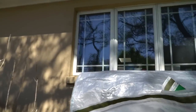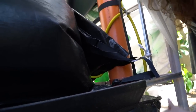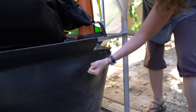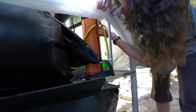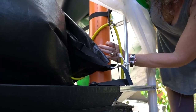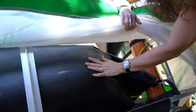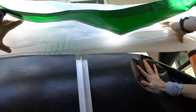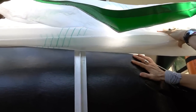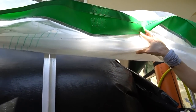When you put your food scraps in, they go through the sink — this is the input — into the digester tank, and that's where all of the digestion takes place. As the bacteria decompose the food scraps, it produces a gas that comes up through this tube. This is a filter for the hydrogen sulfide, which would otherwise have a rotten egg smell, so they take that out. Then the clean biogas goes into the gas bag — it's full right now — and it's about 65% methane and 35% carbon dioxide, depending on what you're feeding it, which creates a really nice flame to cook on.